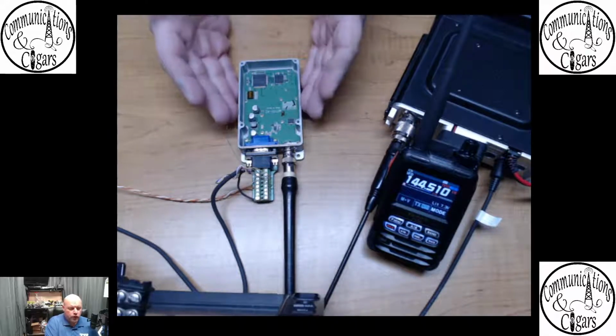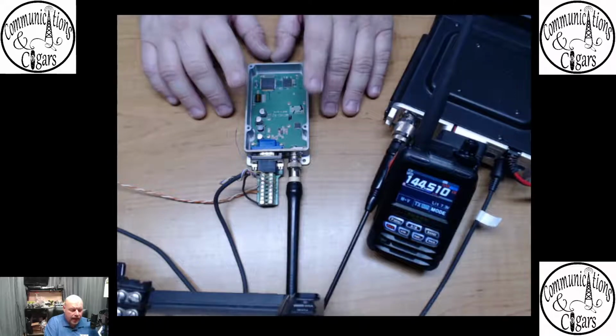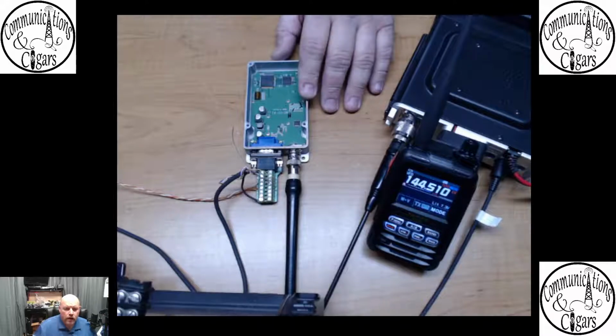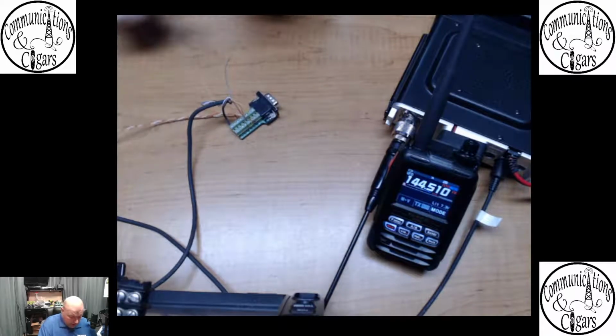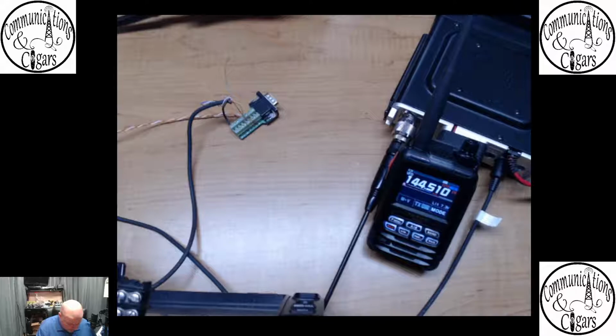Could we do this with other things? Could we hook this DMR radio up into a P25 radio? Oh, hell yeah. Easily we could. Okay. Can we take this radio and go analog into it and then do an analog radio? And the answer is yes, it is here. So let me go ahead and actually pull up my manual here real quick. You guys can't see it off screen there. But we're going to go ahead and change it from channel 1 to channel 2 here. So I'm going to unplug the radio real quick here. And I'm going to get kind of granular because it's difficult to see here. But channel value, so pin 5 has got to go down. Whoop. And this is the crappy part about pins. Okay.